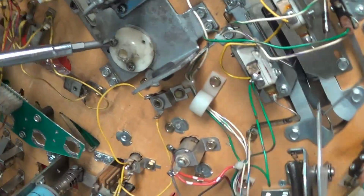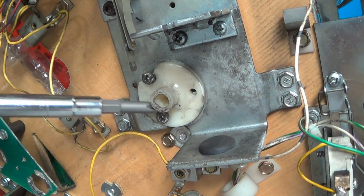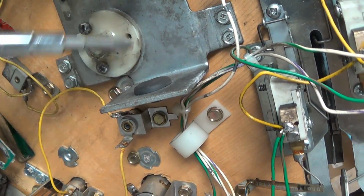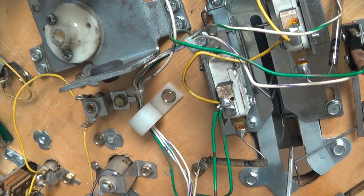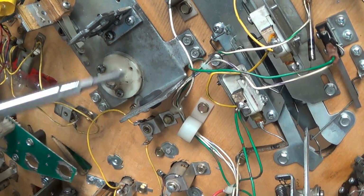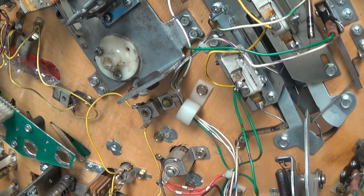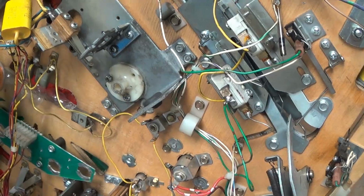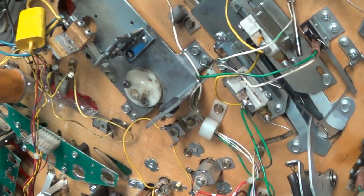This was probably broke and had parts missing when it was reconditioned, because that's unusual breakage, and these generally don't loosen up unless you leave one out. It's hard to say, but this doesn't break during normal play. But if you allow this to come loose or this is worn, it'll do this later on. I've seen it where they all fall out. But regardless of what happened, it's a reason to redo the kit and replace parts. Replace everything. You're going to get your flipper power back.